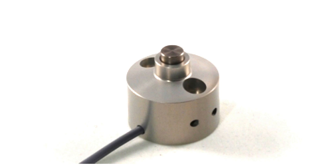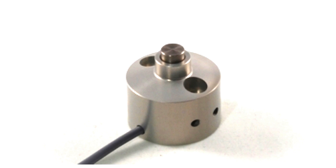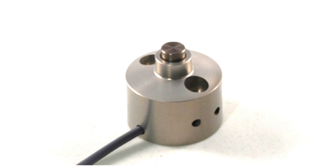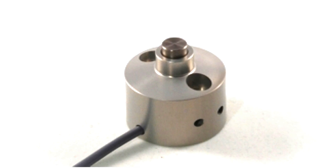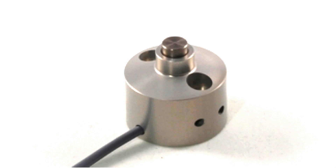The first item in this section is the tool length sensor. The tool length sensor is used to automatically adjust the Z height of your tool. Normally you would bring your tool down until it just touches the surface of your work material, and you could use a piece of paper until it pinches to verify that you've got the tool exactly on the top surface of your work material.